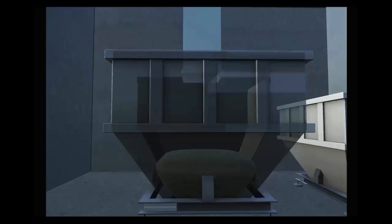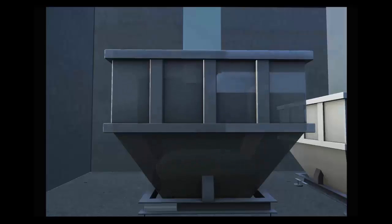Once all the ingredients are weighed, the major scale will discharge first to fill any of the dead space between the ribbon or paddles and the bottom of the mixer tub. The minor scale discharges after a 5 to 10 second delay, and the minor ingredients begin to mix with the major ingredients. The micro scale discharges after a 5 to 10 second delay, and the micro ingredients begin to mix with the minor and major ingredients.